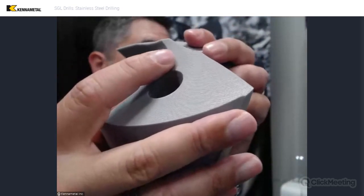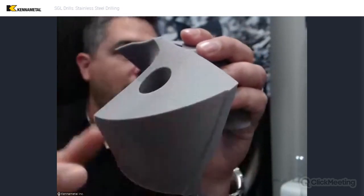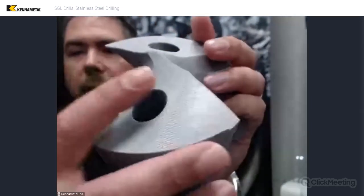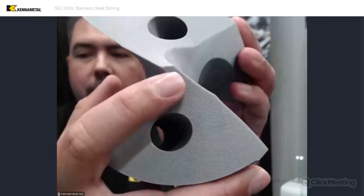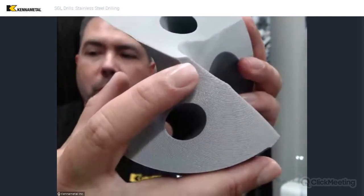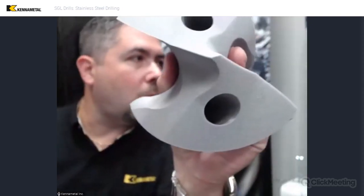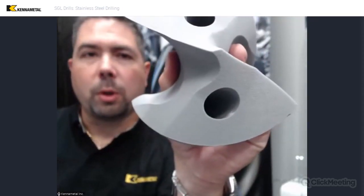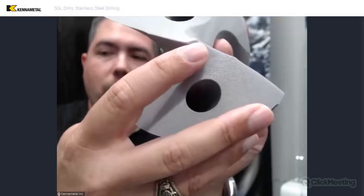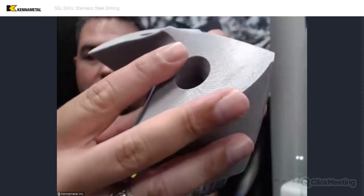We've also got the fact that it's not a traditional normal cutting edge — we're actually extruding material right here, pushing it out of the way. That really creates a lot of force. So if we can reduce the length of that, we see an immediate benefit in the forces. We also see a big benefit in how well the drill can center. Some people call it wobbling, some people call it walking, but the more we can get this drill to stabilize and start drilling well on contact, the better.